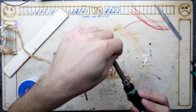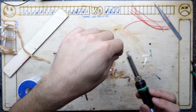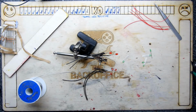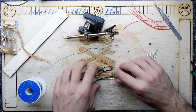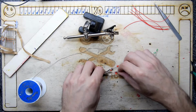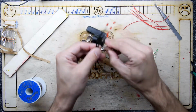So yeah, you don't need the reset button then, and it can be totally potted, and, not potted's not the right word. It's overmolded. It'll be a resin overmold, which will be awesome. And the nice thing about resin is you can add all sorts of things. So if you wanted to, you can add other particles, not only toner-like colour ones, but you can add other plastics, like people add ABS, glass reinforcement.